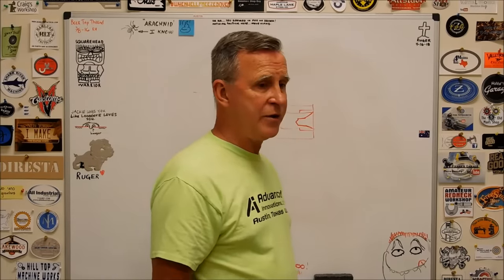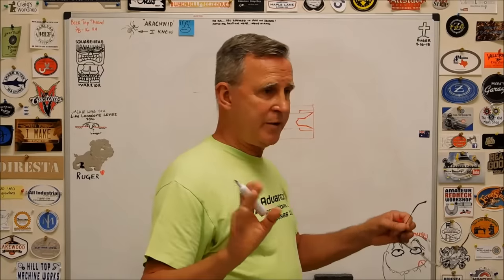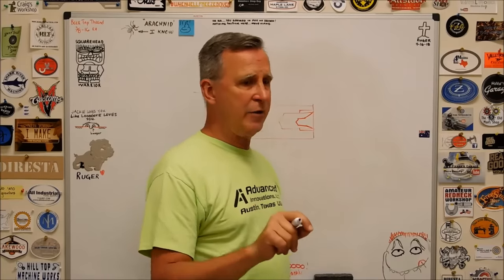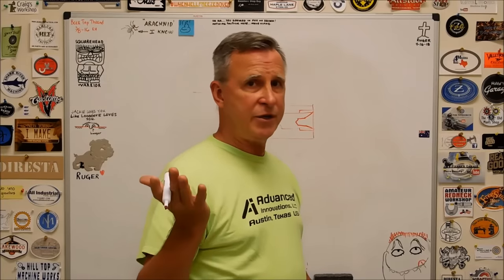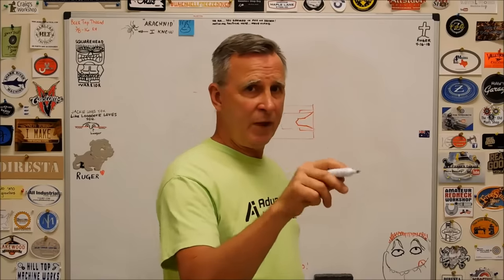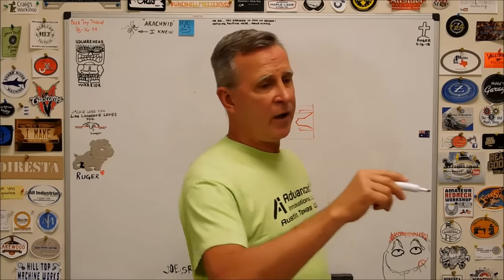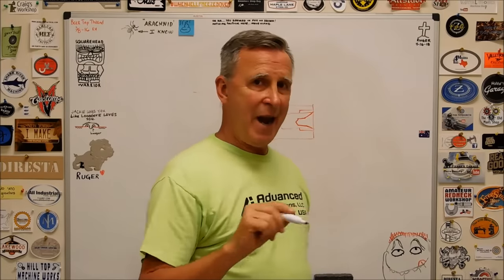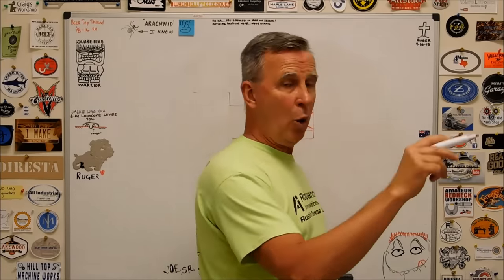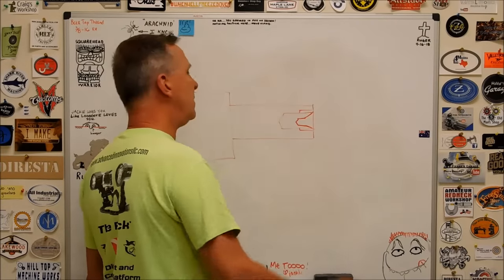The only way to make sure it's a true hole is to bore it. I don't care how many guys are going to scream and say, oh, I can do it with a reamer. You're never going to get the same concentricity accuracy that you will with a boring bar. You won't, because drills and reamers are slaves to the pilot. If it's a wallered out hole and it's going eccentric, when you stick a reamer in there, it's not going to true it up. It's going to follow that ugly hole. It's going to open it up, but it's not going to true it up. The only way to do that is with a boring bar, okay?